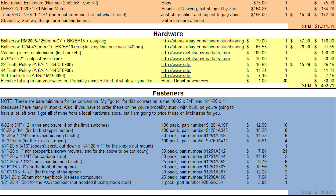Various pieces of aluminum for brackets — it's probably not really $100 but that's what I put down. The tool post riser block: if you're going to get rid of the compound rest, you won't need the compound once you're CNC'd, and on this lathe it's a notoriously flimsy component anyway, so why not eliminate it? I felt $30 was too much for a chunk of 1018 steel, but that's what it was. Then there's a 22-tooth, 44-tooth, and 150-tooth belt for the 2-to-1 pulley reduction on the X-axis.